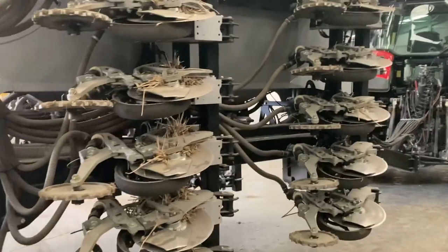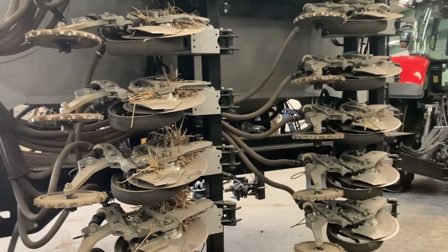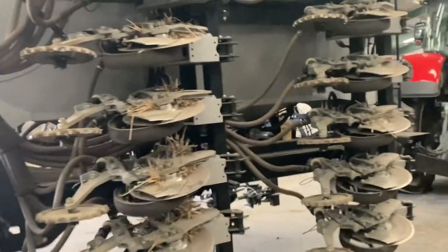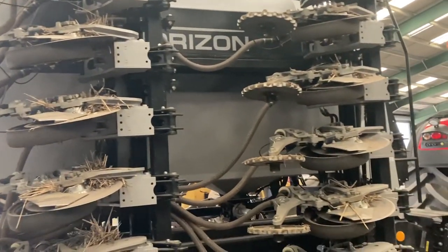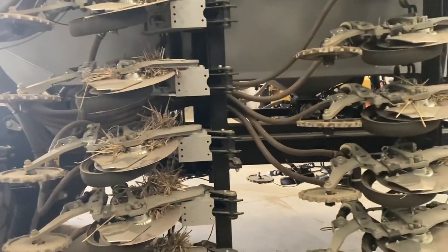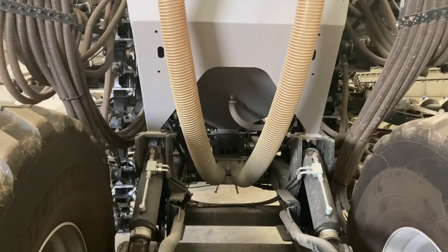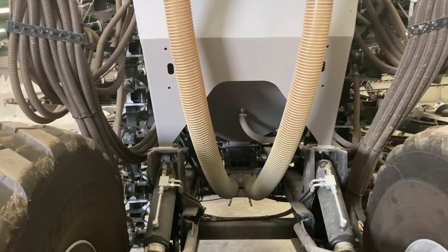you can drill with the front and the back coulters, or just the front coulters and use the back coulters for another seed or a companion crop, or use both hoppers. I mean, this does come as a three hopper version as well, but this is just a two. So I generally put seed in the front and fertilizer in the back hopper, and you can direct that straight into both venturis at the back, so it's mixed together, so there's seed and fertilizer going to both front and back, but it just gives you that versatility.